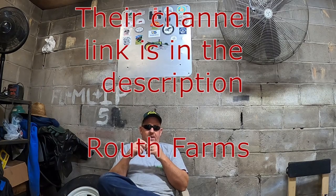Really appreciate everything that you did. They were knee deep in a project of their own this morning. Gave me a couple hours to get things acclimated, came up, and I had it running by then. We had a little bit of an issue with a bearing on the main drive pulley off the back of the motor. It was making a noise. I was kind of at a loss. We didn't really have the right puller, but we made it work. Took three of us, we got it off, packed grease in there, put the seal back. Luke got the seal out and in twice without messing it up, packed it full of grease. That enabled me to go ahead and run the combine without doing damage to that shaft or the bearing, because the grease was just pretty much non-existent in there. So that'll be one. I've talked to Tim Flegel about it. Those are easily accessible bearings to get and to replace, so that's not going to be an issue.